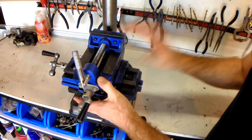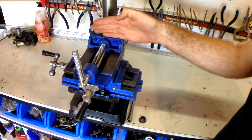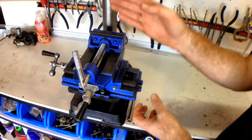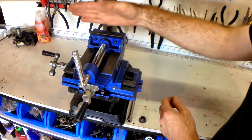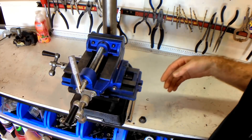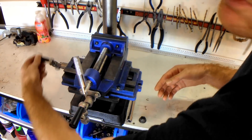The reason I really love my sliding table on my drill press is that when I have a workpiece in here, I don't have to keep moving it and reclamping the vise when I want to drill holes. I just clamp it once and then I can move the workpiece to reposition for the next holes. So I don't actually use it to mill.